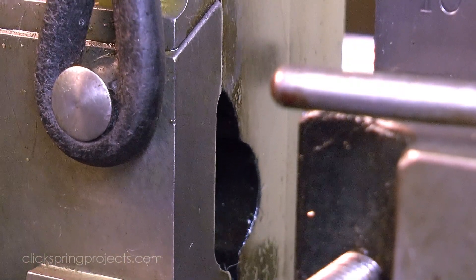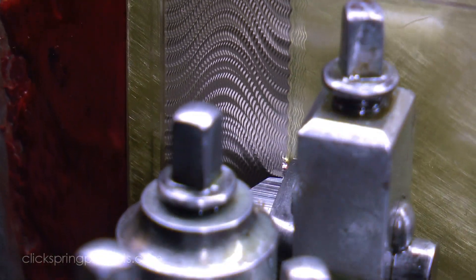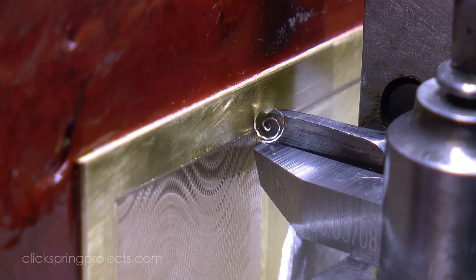This in turn oscillates the workpiece from side to side to superimpose the pattern onto the cut. And the pattern bar can be shifted up or down or phased between the cuts to generate interesting pattern development over a repeated series of lines.